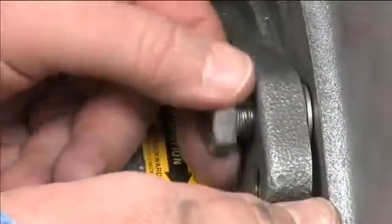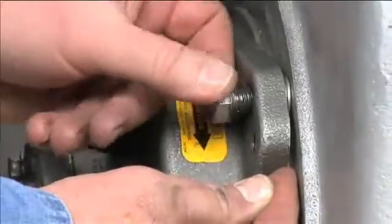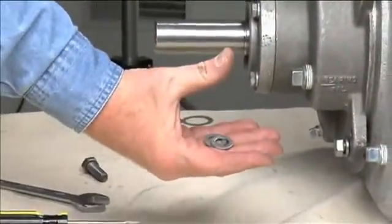Additional back cover plate adjustment is provided by removing spacers between the rotating assembly and volute casing. This design extends the service life of the wear plate and impeller by doubling the amount of available adjustment.